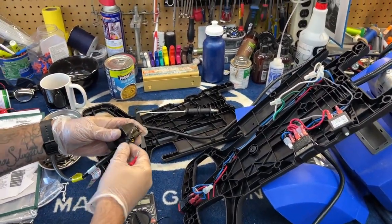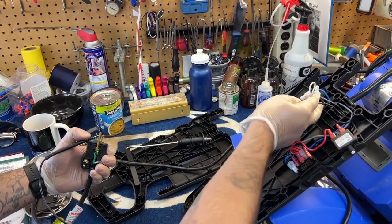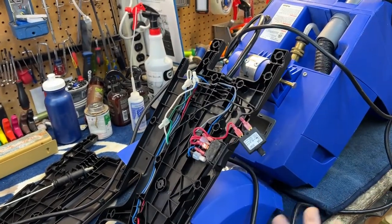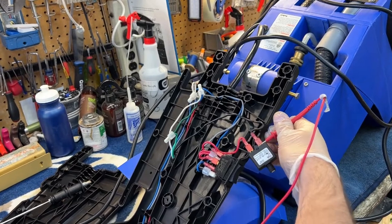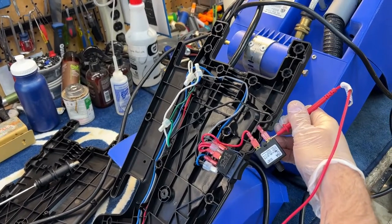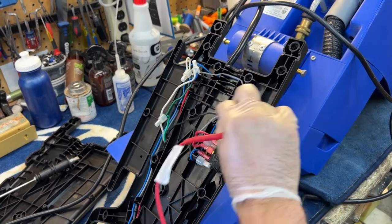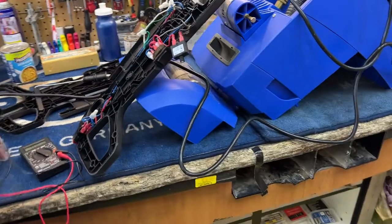I'm going to test the other side, which is the black side. I'll trace that cord right here, and you can see that cord is actually going into the breaker, and I have some contact I can make. Right there I have no continuity — you'll hear that my multimeter is not beeping. So the black cord, somewhere inside this power cord, the black cord is broken. So I'm going to go ahead and replace this cord.